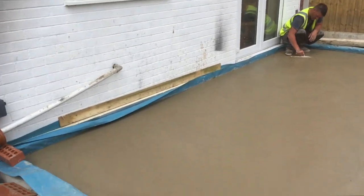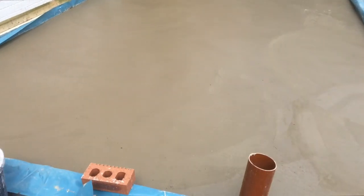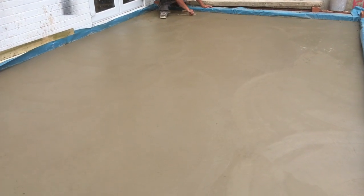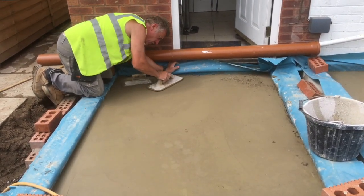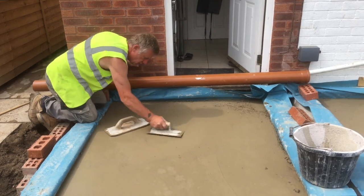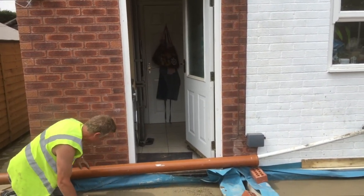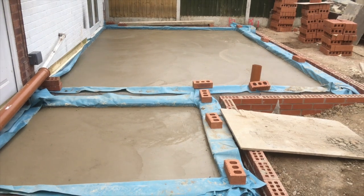If you can see the rest of the slab, that's it. Matthew is just finishing the bottom. A lot of you critics out there might wonder why we're doing a finished floor even though we're below finished floor level on the oversite — just to make it easier for the guys putting the underfloor heating on. So there you go. Thanks for joining us. And the most important job of the day, Chris is putting the kettle on. Still in training. End of the day, that's the job done. Catch you in the superstructure.